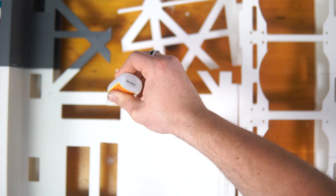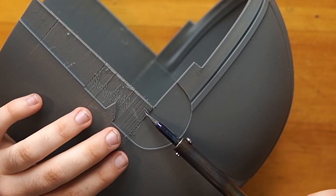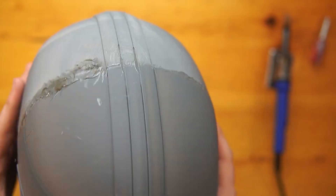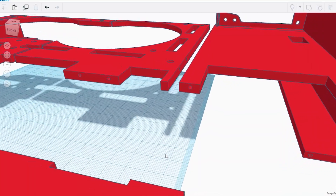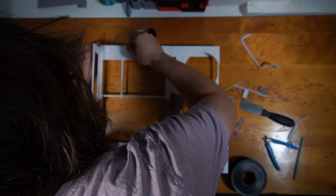Now that it's in pieces, I needed a way to align everything perfectly while putting it together. I considered a few different options. Option one: glue everything together with gorilla glue. Option two: create some sort of mechanism to align all the pieces correctly. Option three: weld the plastic together using a soldering iron — I didn't want to do this because I'd done it without a mask and the fumes made me very sick. In the end, I went with a mixture of option one and two: I designed small holes into each piece so I could insert filament to help align everything.